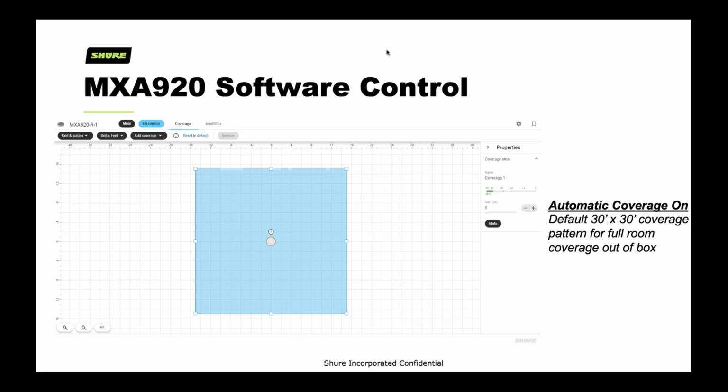Okay. The SHURE Device Discovery. And the Designer itself. And all of those are free? All of those are free. And available on the website, shure.com? Yep. Perfect. The Device Discovery will search the entire network, even if it's a different IP, even if it's a different gateway. It doesn't matter. If it's connected, it will find it. And it will tell you all the exact addresses, so you can see if it's in a different network. You can see everything right from that software. That's all it does.